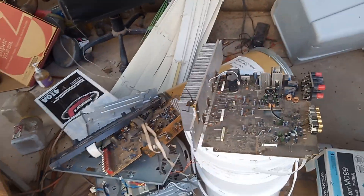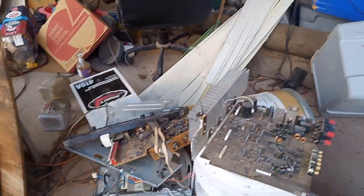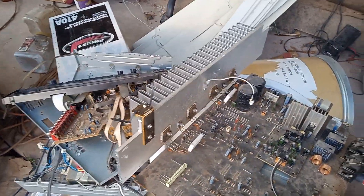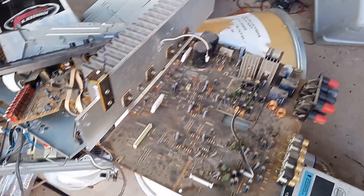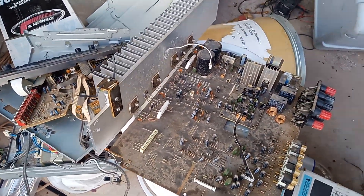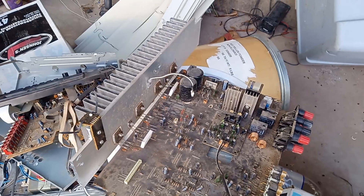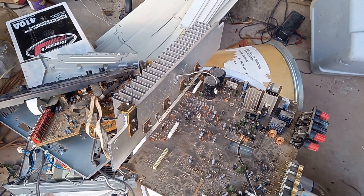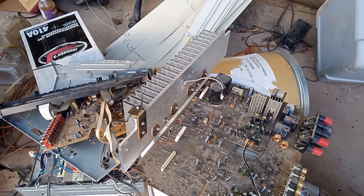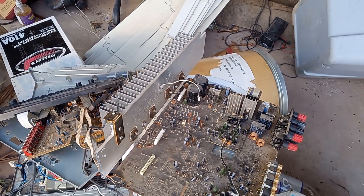I'm after this big old heat sink. I've got some power transistors, some circuits for power transistors, and I'm thinking about using a heat sink. What I'd probably do is unsolder all those transistors. There's two — they're obviously push-pull, NPN, PNP, NPN configuration, and one driver transistor in the middle of those two. That's how that's configured.